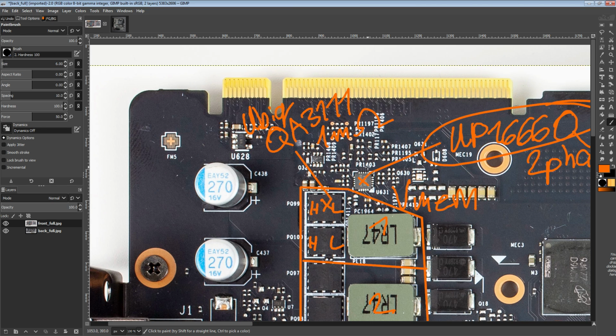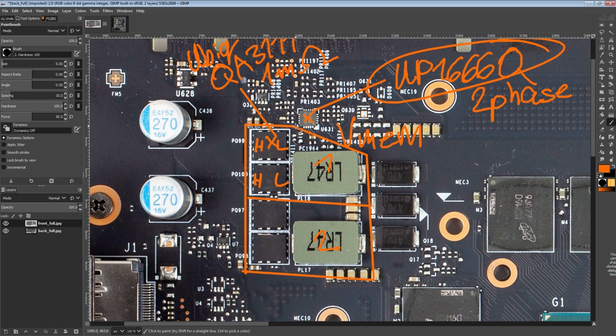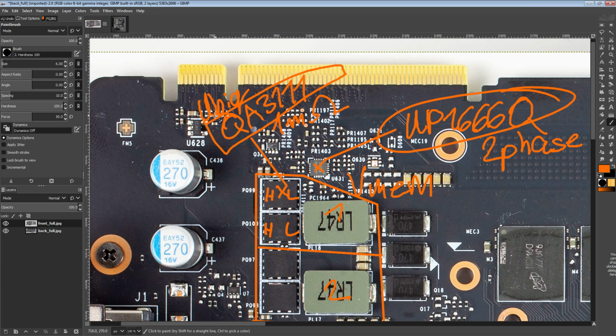As a result, their switching losses completely negate any gains from the RDS(on). I was very, very surprised when I saw the datasheet for these, because these are some of the slowest MOSFETs I've seen in a while. There are obviously high-power MOSFETs for motor drive, and those are far slower than anything we'd be looking at here. You're talking hundreds of nanoseconds to switch them on and off, whereas for VRMs you'd be looking at tens of nanoseconds at most. But for as far as things I've seen in VRMs, these are slow. These are really freaking slow.